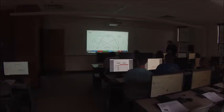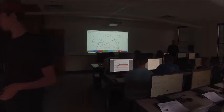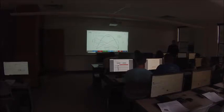So if you think about it, when you start at zero and you apply power to the motor, it's going to accelerate really fast right away because you have a lot of torque, right? It'll accelerate, just the shaft of the motor will accelerate really fast. But as it accelerates, it moves right on this graph, okay? And as you move right on this graph, the torque decreases. So you're still accelerating, because there's still torque present, but the torque is decreasing, so the rate at which you're accelerating is decreasing the faster and faster you get. Basically, eventually you reach a point where you're not generating any torque anymore. And if you don't have any torque, you can't accelerate. Right? So that's really what causes there to be a freeload speed.